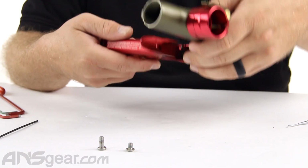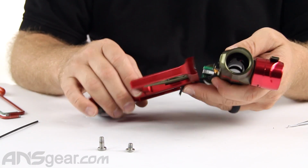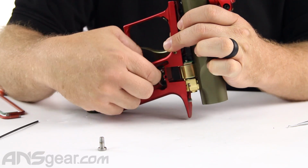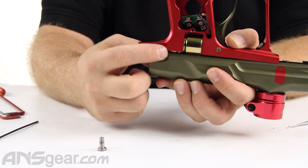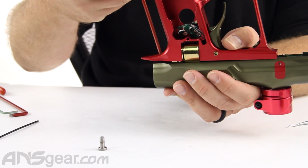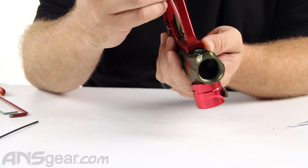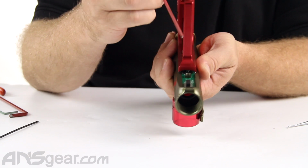So I'm going to put that in first so that my wire pokes through. Then I'm going to put my screw in. I'm going to slide everything together, make sure that this wire gets out of the way. And you see that it will not touch. It won't be flush with the body because that screw actually needs to drop down in before the body will go flush. Then we can take this middle screw and put it in, so that it actually goes down straight first.